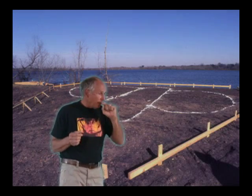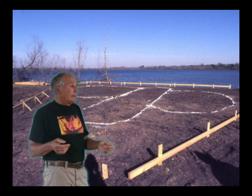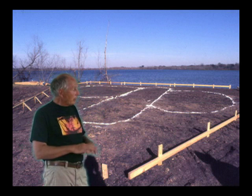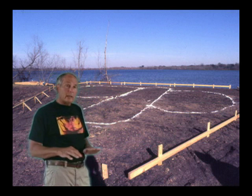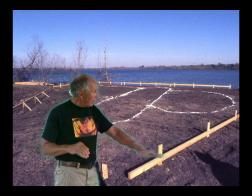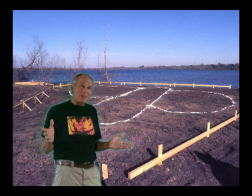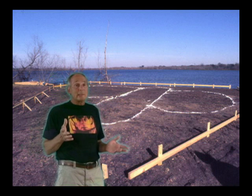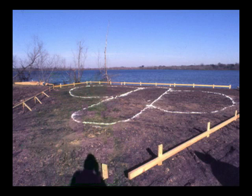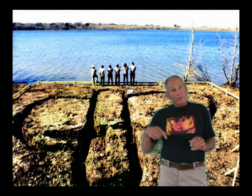This is a series of shots showing how the ferrocement shell was built. First of all, we laid a string line of a 36-inch grid — a horizontal grid. It was called level zero, and that was a flat line. We laid that out and chalked it with line. And for the first time, we were able to see the real scale of that little model we built, and we were all blown away.